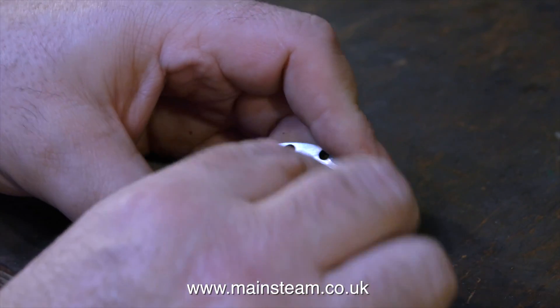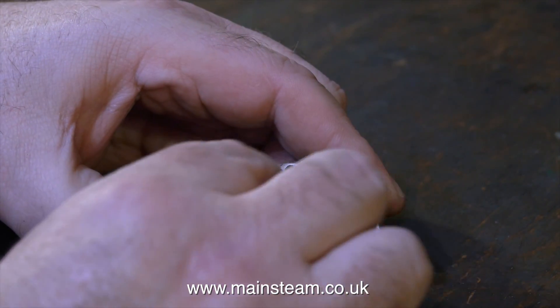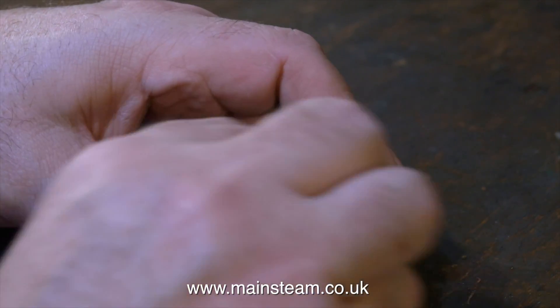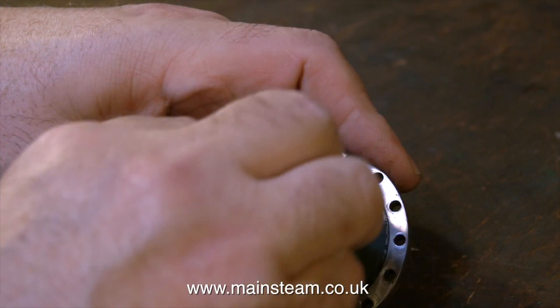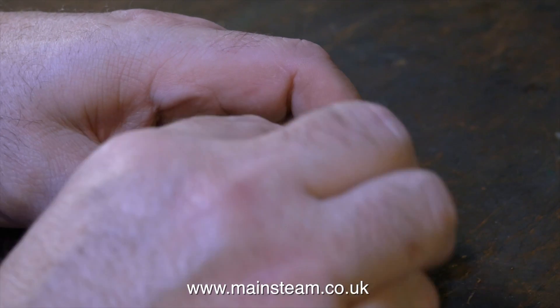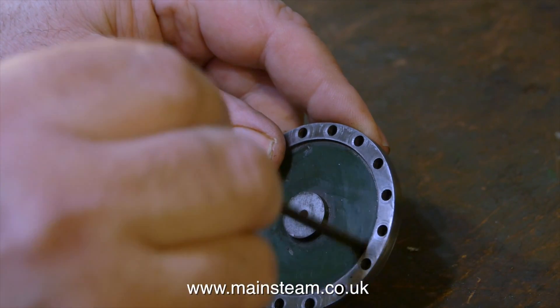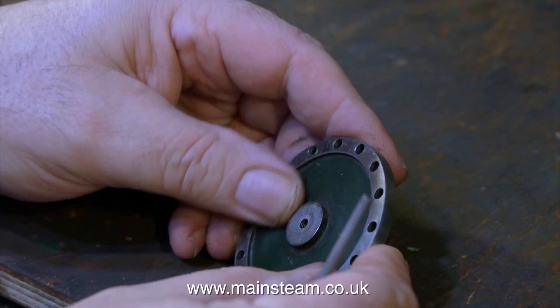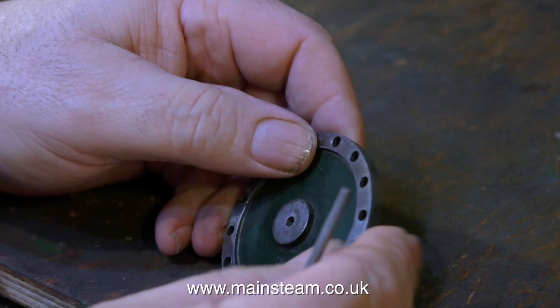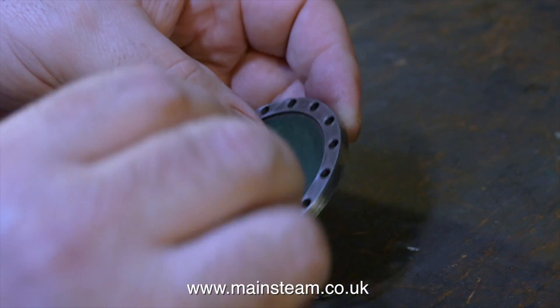Back to the rebuild — this is the top cylinder cover. The paint is well stuck to it but in places it's a little flaky, so I'll key the paint and use the existing paint as a base coat. I'm using a combination of wet or dry sandpaper and a small needle file. Once I thoroughly removed any loose paint and keyed the existing paint, I cleaned the surface with white spirit and then painted it.